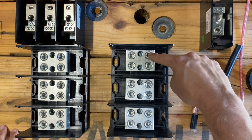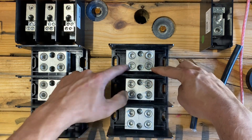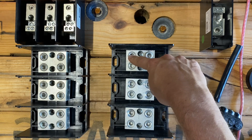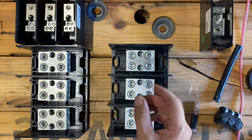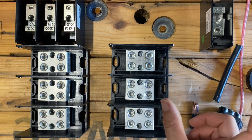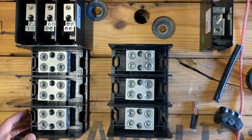This is where you distribute the grid power when it comes into the wireway. You could bring grid in right here, feed two Solar 15Ks out of this one and this one, and then maybe this one feeds your transfer switch. You do that with L1, neutral, L2, and then obviously grounds go to a little ground bar — you don't have to go overkill with the grounds.